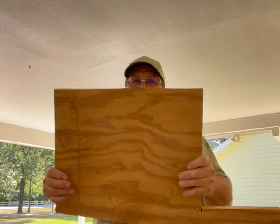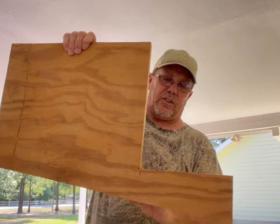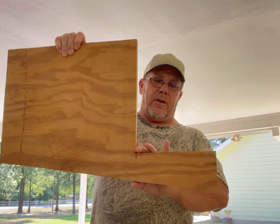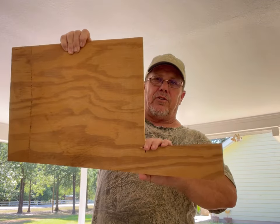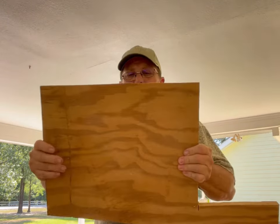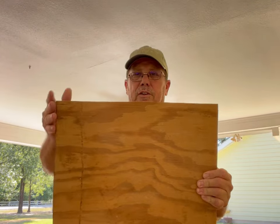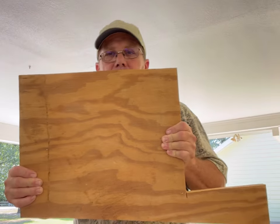Okay, so I made my first board with a 3-inch slope in 16 inches. I left a little section going out for the eggs to roll out of the chicken coop. I'll cut the wire to let this slide out of the chicken coop, and the egg box will be this part inside the coop. I've got my first one cut 16 inches this way. It's like 12 or 13 inches this high, and that's going to be the wall of the egg box.